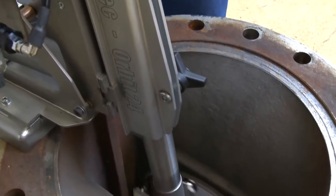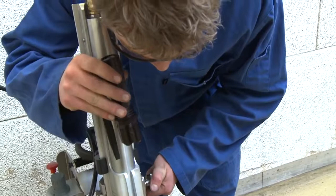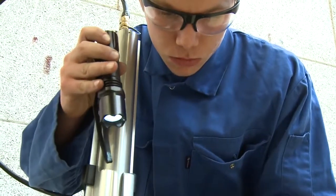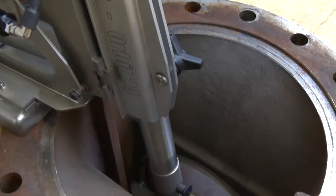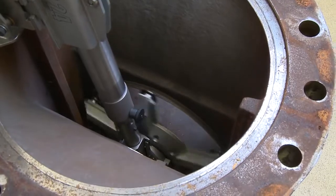There is no need for very accurate and time-consuming diametrical adjustment to the sealing face as needed with conventional machines. Last but not least, there is no need for applying an extended force to make the discs rotate as needed with conventional friction driven machines. This way, the Orbit enables accurate control to achieve the finest finishing.